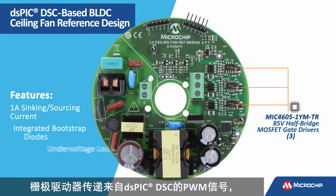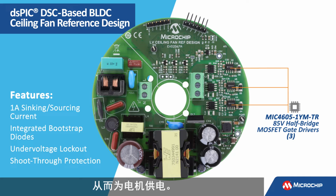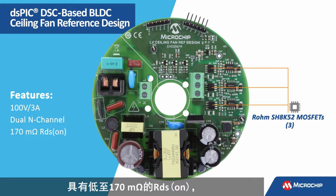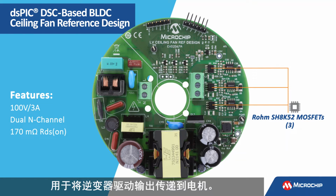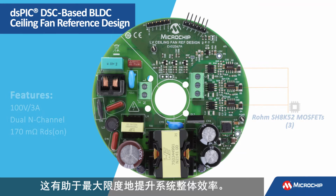The gate drivers pass through the PWM signals from the dsPIC DSC that turn the MOSFETs on and off to power the motor. Their 85-volt operational capability supports running motors up to 48 volts. 3 ROHM 100-volt 3-amp dual N-channel MOSFETs with a low 170 milliohm RDS(ON) complete the inverter drive output to the motor. The 10-volt output level from the buck converter was selected to reduce the RDS(ON) from the MOSFETs, which helps to maximize the overall system efficiency.